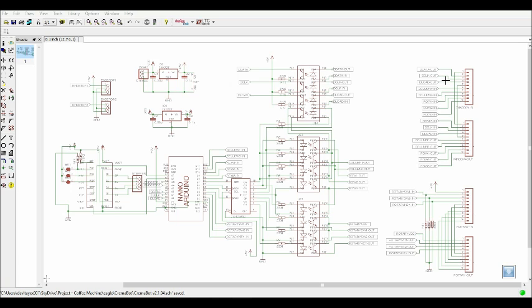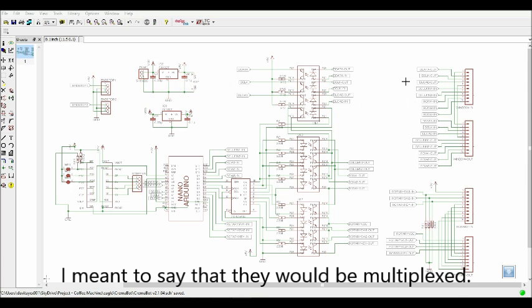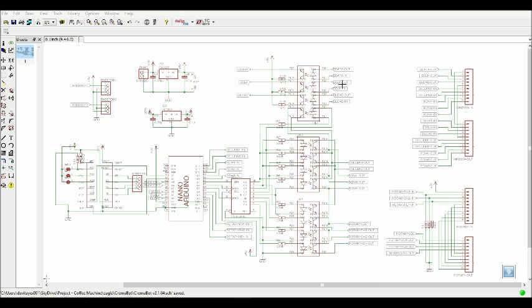So in this case, it's going to come in. The Jura has a 10-character one-line display. So the assumption is that there's 10 of these 74595s, all connected together in a daisy chain fashion. So the data line is going to push through data bytes, if you could call it that, one for each character, and then it's going to pulse width modulate between those displays to enable and disable the displays as required to display the actual data on the screen. I'm hoping to actually be able to read that data out in real time, push that through the USB interface to the DLL, and then on via SignalR to the web app, so that you can actually just see on the web app exactly what's happening on the display on the real machine.